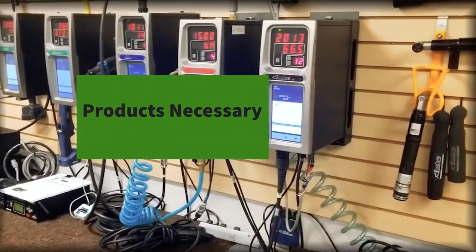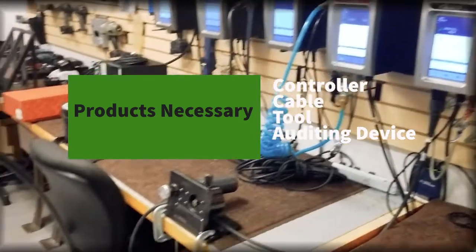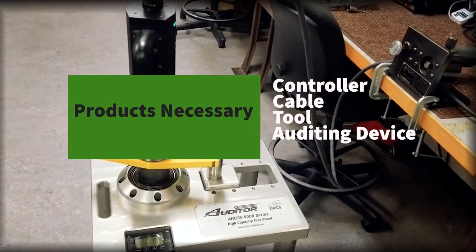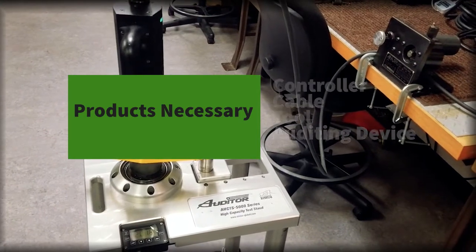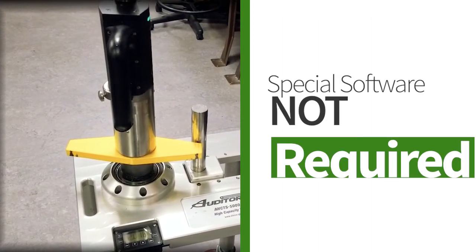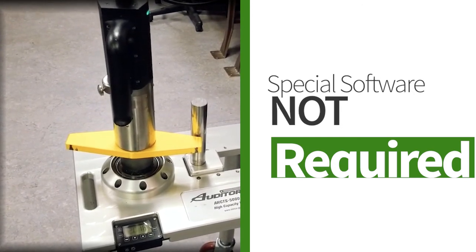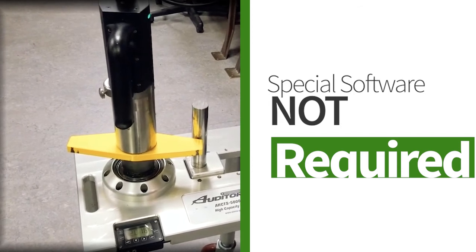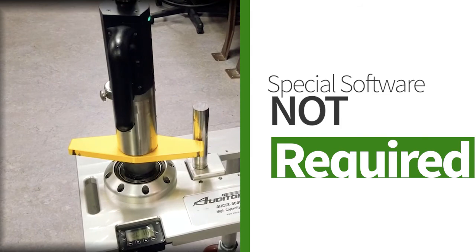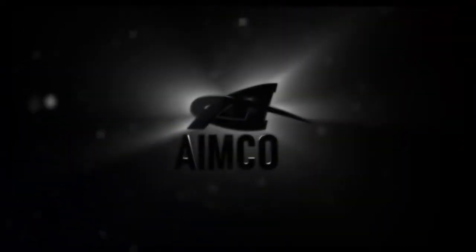In summary, you have the Acrodyne system with a controller, cable, and tool, plus an auditing device. AIMCO can provide that auditing device, or any locally approved auditing device that follows locally approved calibration standards can serve as your master. There is no special software, no downloads, and no licenses required to perform what you saw — the Torque Calibration Routine is an integral part of the ACE Generation 4 Acrodyne control platform.